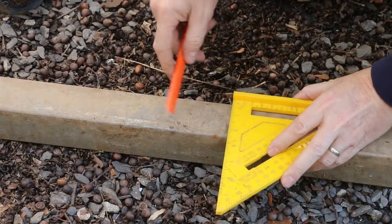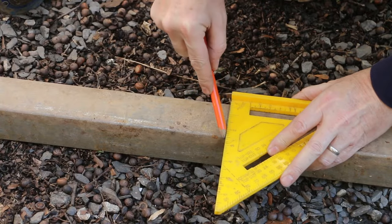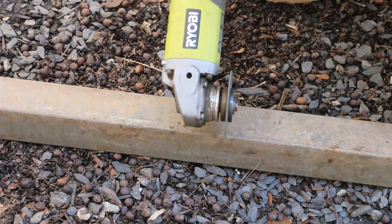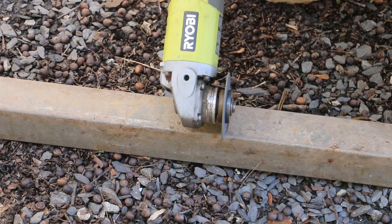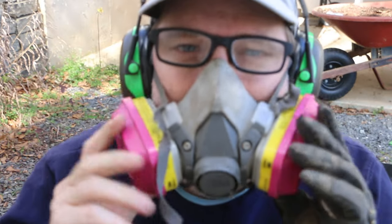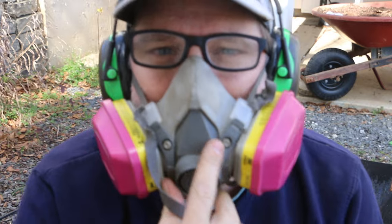I'm sure some of you have already noticed, and maybe have fingers twitching to leave a comment, that this is galvanized. So I'm going to need to take that coating off before I weld it. Eyes and ears, JW. And while I'm grinding, I am wearing a respirator.